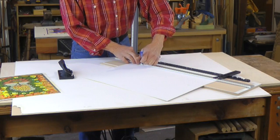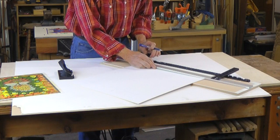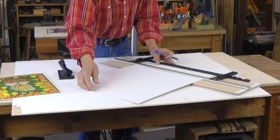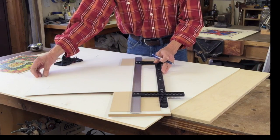These 3 sides are the same so it's easy to do that. Now the bottom is a little different — it's going to be out to 4 inches, so I can move it over to the 4. And if I needed that wider — 4 and an eighth, 4 and a quarter — any different dimension you need, it's real easy and fast to set.